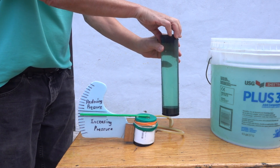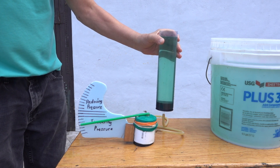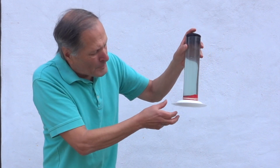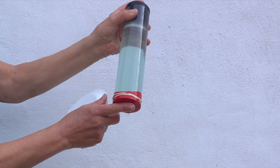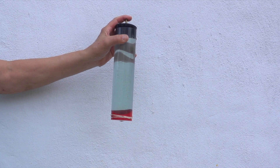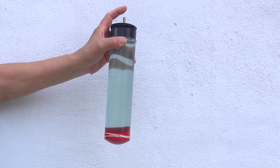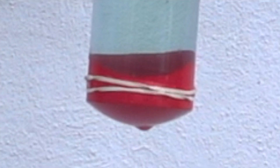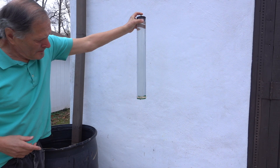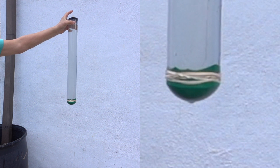Let's see what happens if I take the top off. By letting the pressure equalize at the top of the container, now we're seeing a higher hydrostatic pressure. Now another way to see what's going on is to replace this bottom lid with a balloon. It looks like it's just flat across the bottom. Now let's see what happens if I let some air into the top. Now we can see that the water does actually push against the surface, as its weight causes it to bow outwards. Let's try it again with the 22 inch tube — the additional water weight stretches the balloon a bit further than the previous one.